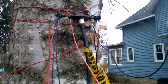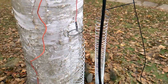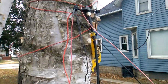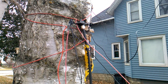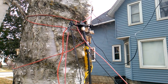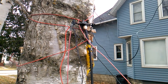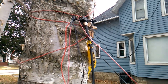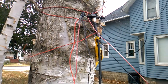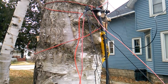Just for good measure, on each end of the center insulator I've got slinkies. Right now I can tune up on 40 meters and 18 megahertz — that's 17 meters. I can't get 20 meters and I can't get 80 meters.